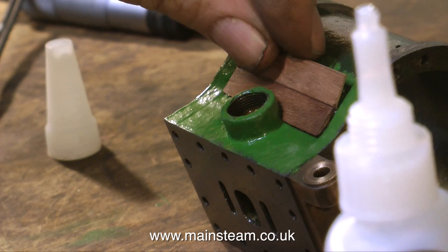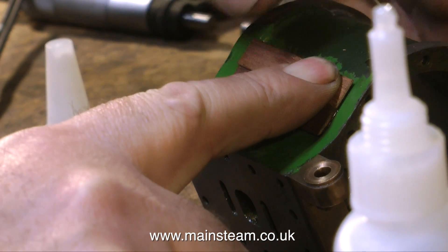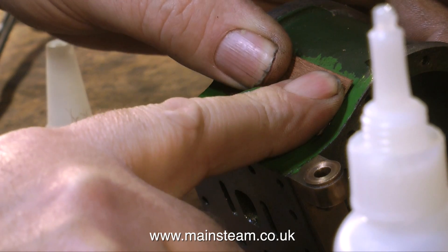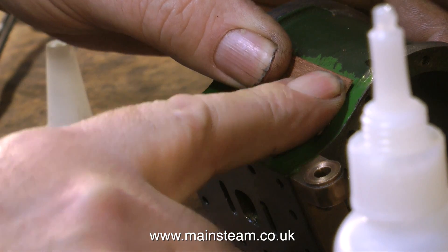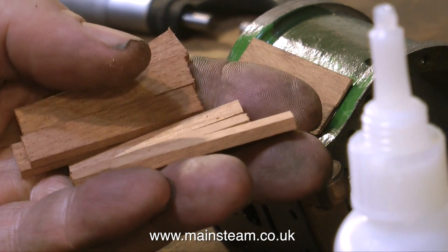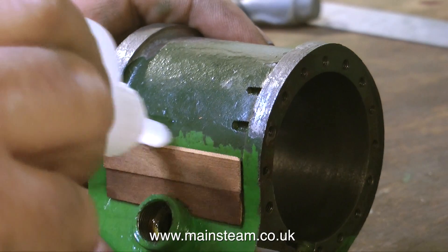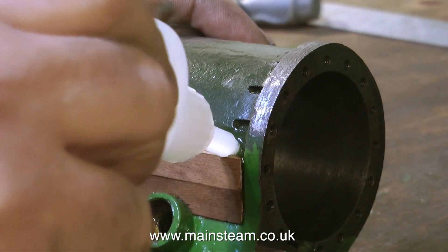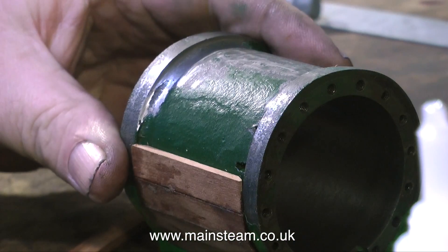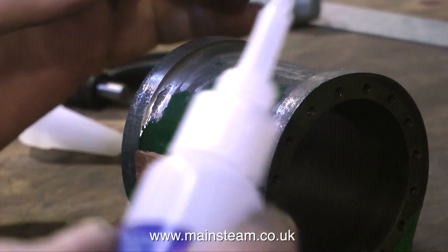What I'm currently doing is using a small drum sander in my drill to radius a piece of mahogany to accurately fit around the exhaust. With each of these pieces I first chamfer each end on the belt sander — this chamfer allows them to fit around the radius on the inside edge of the flange. I also have to trim one edge of each piece so they all sit together quite nicely.